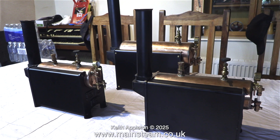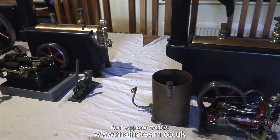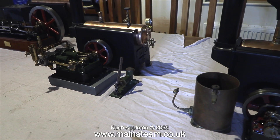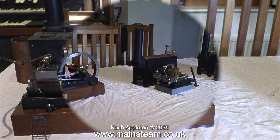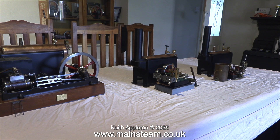And here we have three boilers — two 501s and one 504 — which now allows me to place them next to the respective engines to figure out the size of baseboards needed. This beautiful Stuart Victoria already has a water tank (the square thing behind it), and the piece of copper tubing obscured by the water tank is going to be the condenser for this particular plant. One of the 501 steam plants already has a water tank, but I'll need to make a water tank for the other one, as well as two condensers, one for each engine.